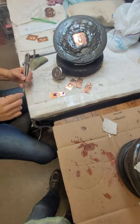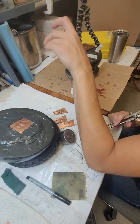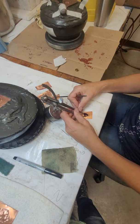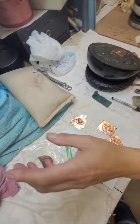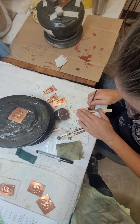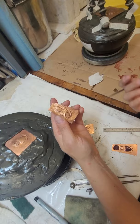These are gigantic, ridiculous dividers. What you do is find your center point on something like this — find your center point however you want to do it. I just happen to have dividers mainly for the video so you can see. Do your measurements however you want, find your center point, mark it with the Sharpie. Always take time to do a layout. You don't have to scribe this in real deep and scratch your metal. It's a whole geometric thing — you have a center point, center point, center point. You have to lay it out so it's not cockeyed.